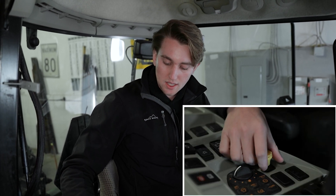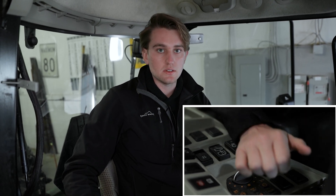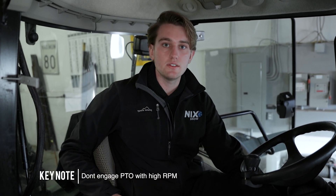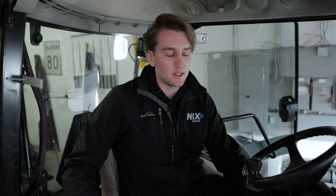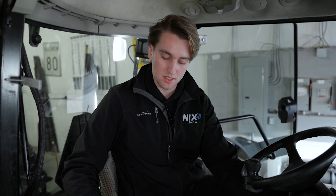A very important control is the PTO on/off. One thing you want to keep in mind is you never want to engage the PTO when you're at full throttle — that's just hard on things. It is electronically engaged, so you're not going to destroy it if you do that, but overall it's not super healthy for the machine. You want to make sure at a lower RPM — anything below about 2000 RPM is fine to engage it, and same thing for disengaging. Turn it on at a low throttle, rev your machine up, do your work, idle it back down, then turn off the PTO.